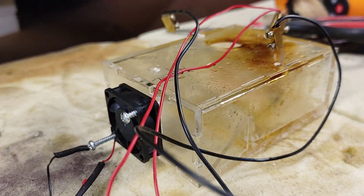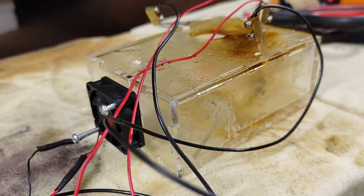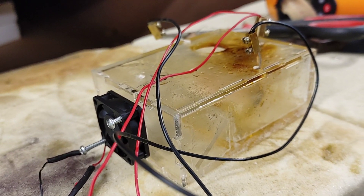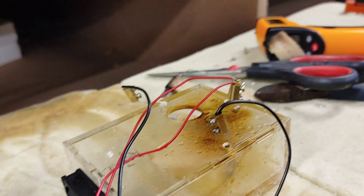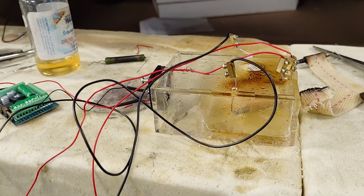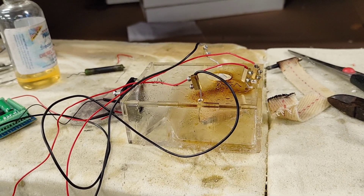When a customer comes to me and must decide what he wants — if he wants cylinder smoke, I'll put a single 10-ohm resistor in there, 10 ohm on the other side to do the cylinder smoke and that'd be the end of that. Personally, I think the cylinder smoke is a bit of a gimmick because you can never get it prototypically 100% right. I prefer volumes of chimney smoke.